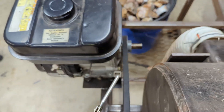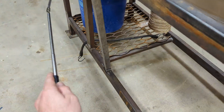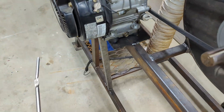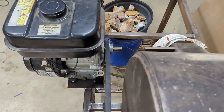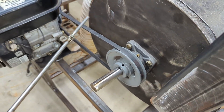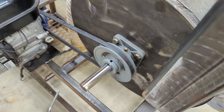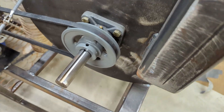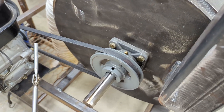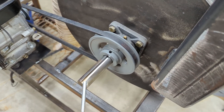Here's a look at the engine again. As you can see, the engine is pretty far off the stand, but that is why I have this piece of metal that I welded onto the cart to support the engine. Here's the 3-inch pulley going to the 5-inch pulley on the drive shaft. Eventually I will get some kind of belt guard, because the belt does tend to be bouncing around when I'm crushing rock. This is a little bit dangerous — maybe just a couple little tack welds and a bolt-on cover for the belt and the shaft that sticks out quite a bit.